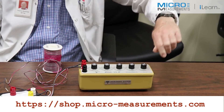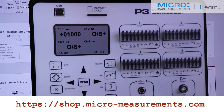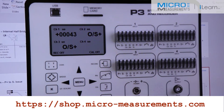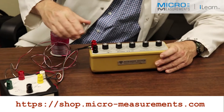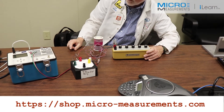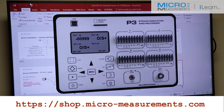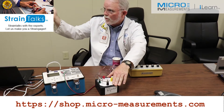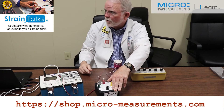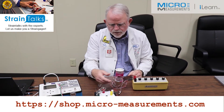First, we're going to simulate that 0.24 ohm change with zero lead wire desensitization. Look at that — almost perfectly a thousand microstrain. Obviously there's no lead wire desensitization. Going back to the original zero, I'll now shunt the active gauge with the 59,880 ohm resistor — it simulates a thousand microstrain based on a gauge factor of 2.0, no lead wire desensitization, no surprise. Shunting the dummy resistor simulates a thousand microstrain in tension, and sure enough it does. With zero lead wire desensitization, the internal half bridge gives you those same numbers — minus a thousand and plus a thousand microstrain. But zero lead wire desensitization will never happen in the real world. You'll never have just six inches of 16-gauge wire connected.